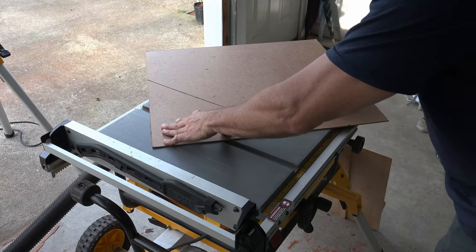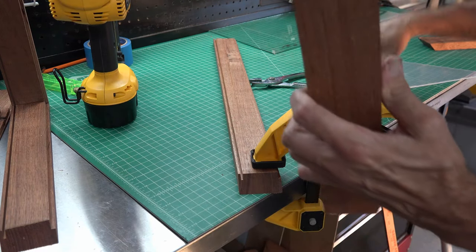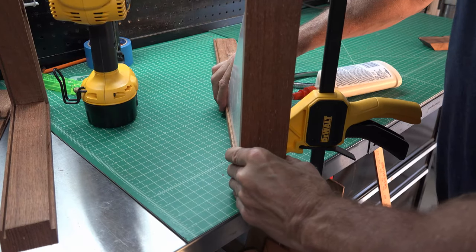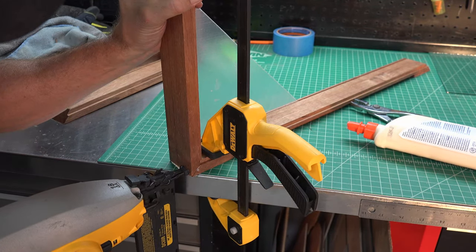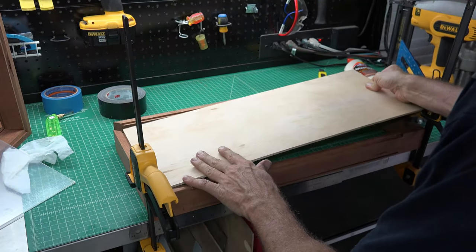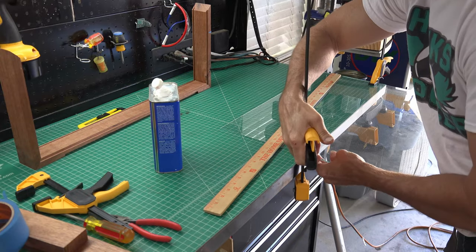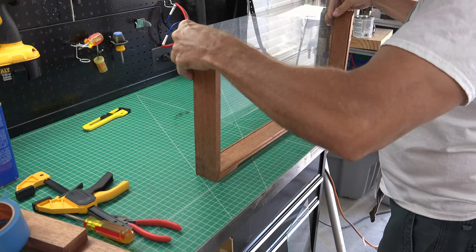Then you can quickly cut out the back plate for the ensign — here I am using tempered hardboard. So real quick, let's put three sides of the main box together. Most important while doing this is to use a small scrap piece of glass or plexiglass so your glass grooves are aligned. As long as the glass grooves are aligned, you will have no issues when it comes time to putting in the glass. It's easier to sand the top or the bottom of the box if there is a little deviation, but if your glass groove is not aligned, things can get pretty complicated. Leave the bottom piece unattached and just place it into position so you can get a good measurement for the back plate. Now we can cut the glass for the bottom rectangle. I dipped my blade in a little bit of paint thinner and struck the glass, then slid the glass over to the edge, re-clamped it to the table, and snapped the glass off. If your glass grooves are aligned, you should have no problem sliding it into your box.